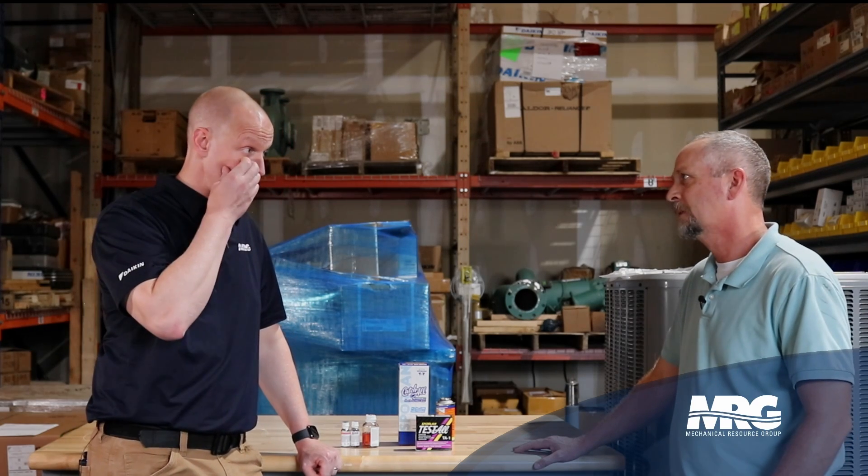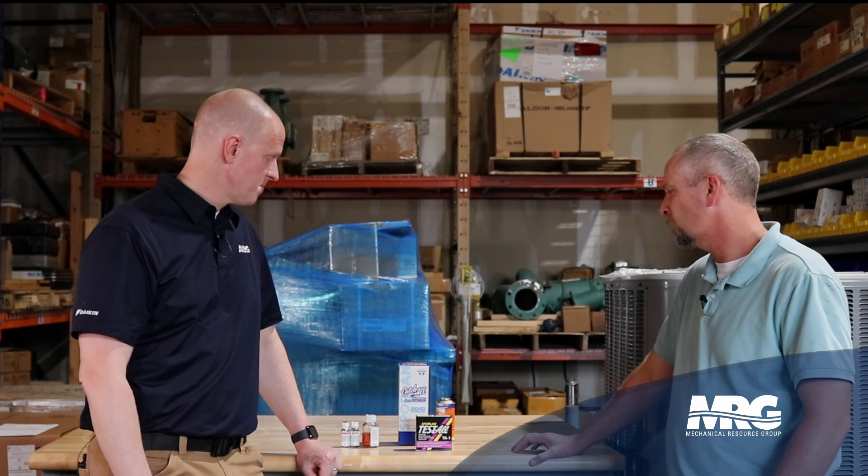I've heard you talk about scheduling a return to pull that suction dryer — about two weeks being the rule of thumb. I'd get back out there after two weeks — I wouldn't wait any longer than two weeks. The quicker you can get to it, the better. The issue is we get busy in this trade and you just can't let it linger. Two weeks would be the max for me. If I felt pretty good walking away from it, pulled a good vacuum, did all my cleanup, I wouldn't be too nervous. But if it were a really dirty one, I'd want to get back to it pretty quick.